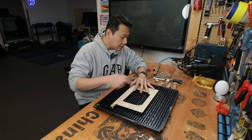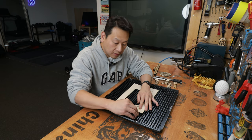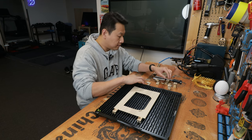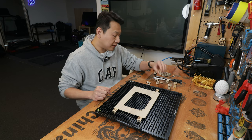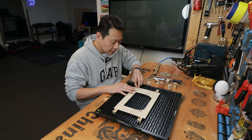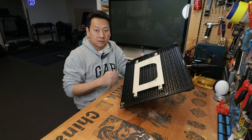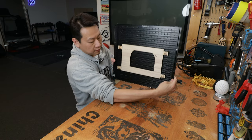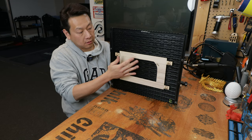Now that corner is pressed down. I do the same with this one here, so now I know this side is kind of secure and then I can move on to this side as well. You can cut as many of these as you want — I've got loads of 3mm plywood scrap that I don't use. With four pieces of this little table slotted in, now we have a secure piece of material that will not move and is relatively flat against the cutting bed.